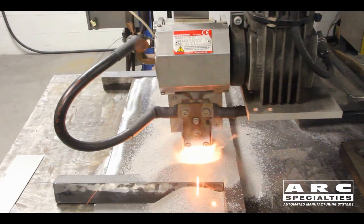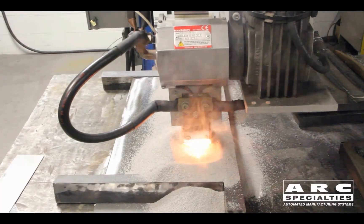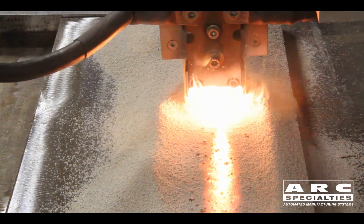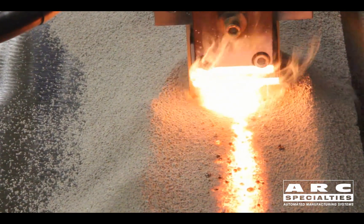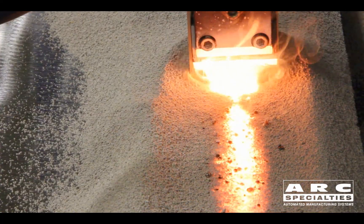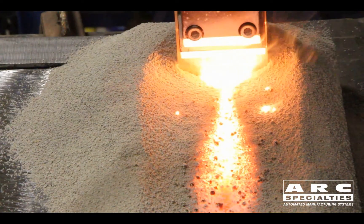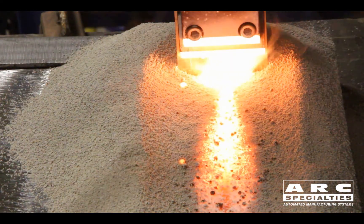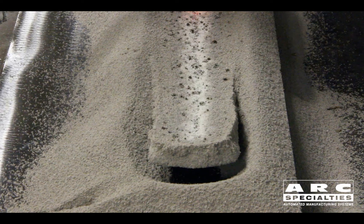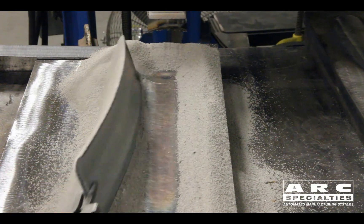Here we are welding with a 60mm strip. Once again, we see the bright molten slag on top of the weld pool. As we move closer, you can see the strip feeding through the contact jaws with some of the flux flowing around the edges. As you look closer, you can see there is no arc on the strip — we are just seeing the bright light from the molten slag. We have a large molten pool, so we need to have a crater fill at the end of the weld. I use about 2 or 3 seconds, and that is usually enough to fill the large pool. The slag should be self-peeling as it cools, and when we turn the slag over, it should be smooth and free of porosity.